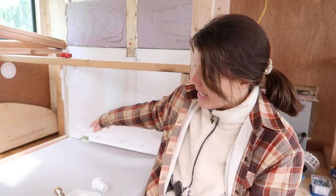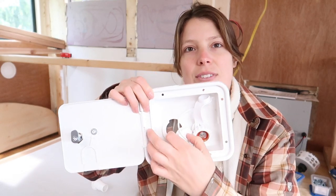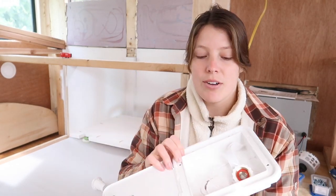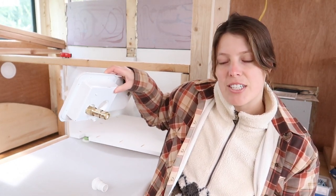It's a new day. My little plumbing appliance box that I built around the water tank is nice and dry and all painted. We are getting ready to install our water inlet that is going to be on the outside of our bus — right next to basically where the water heater door is. This door will be on the outside of the bus. It opens up and has our gravity fill inlet, our hose hookup, and a vent at the bottom that our air vent will hook up into. We're going to do the same as we did last week cutting the hole for the water heater — cut it out with the angle grinder from the outside, cut through the middle first, and drill the hole so that this inlet is right where our plumbing fixtures are going to be.